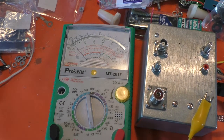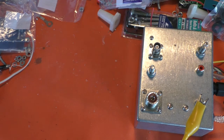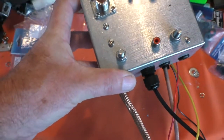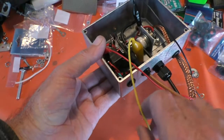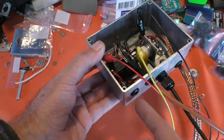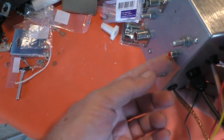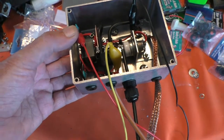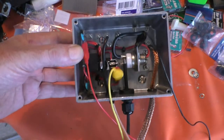So that's the switching module switching as it's supposed to do. All I need to do now is put the back on that and de-energise that relay — that's the thing that's going to be bolted to the back panel. This is the 12 volt supply which is going to go up through that grommet there and be soldered on. The PTT line will be plugging in there, and the braid will be going to the chassis. This black wire connects the negative of the 12 volt supply, and the yellow one is simulating the key.